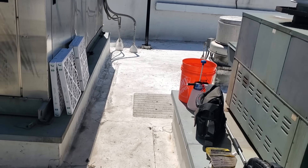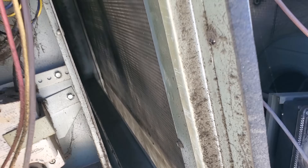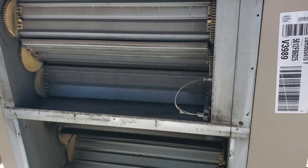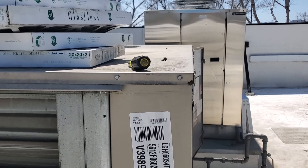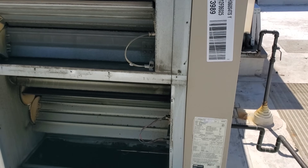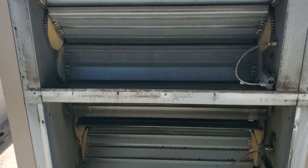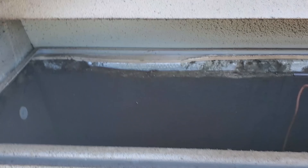I'm back with some filters. I wanted to clean up this evaporator, but it's not horrible — it's dirty, but usually you can pull these economizer packages out. This one can come out, just a little more difficult than I was planning. I'm probably going to have to pop the top a little bit. I don't want to have to disassemble this entire unit because it's not that bad in there — there's just a good spot right in the middle. But I sure would like to clean that coil.